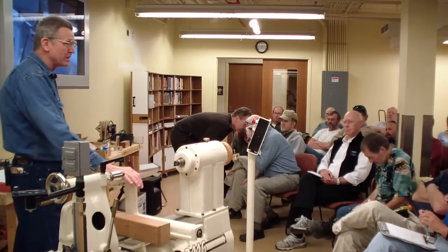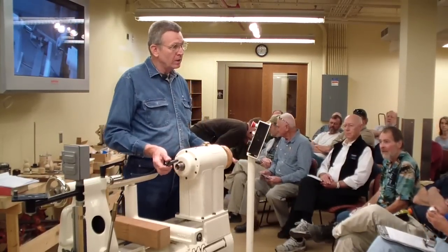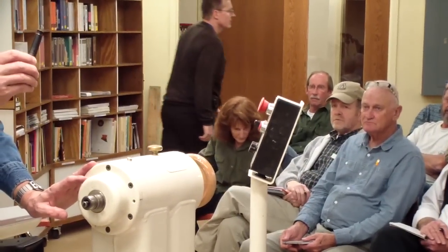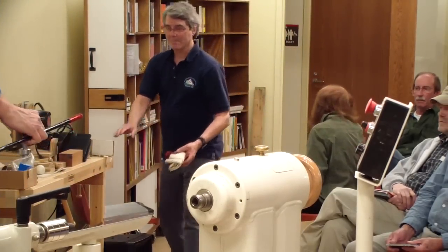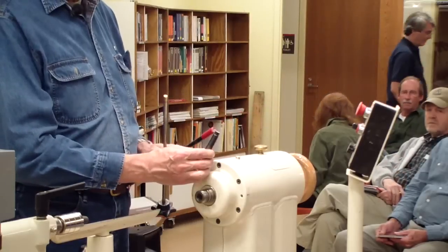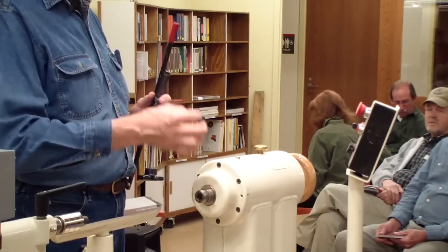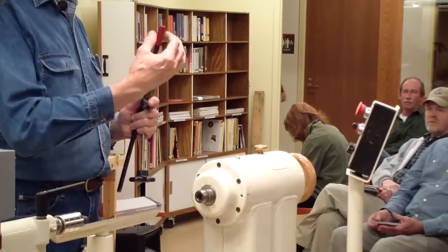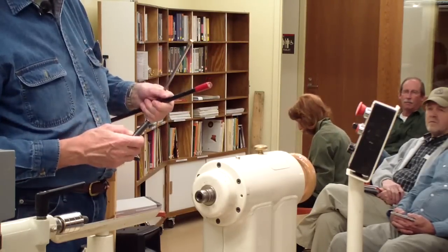First thing we'll talk about is the lathe itself. This has a steel knockout bar. They have recessed the back part of this Morse taper because they weren't smart enough to give you a proper bar with a brass tip. So if you have a steel bar, you're going to have mushroom centers. If your center has not been relieved, such as this one, you will mushroom the swallow in your lathe. The one that John C. Campbell has will mushroom over in excess of a 1/16 of an inch. All you have to do is put a brass tip on there.